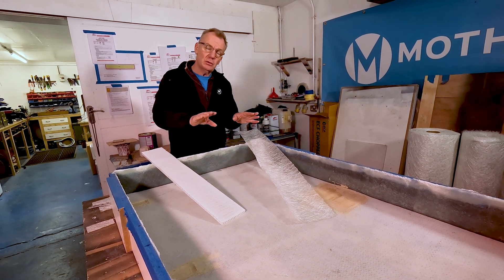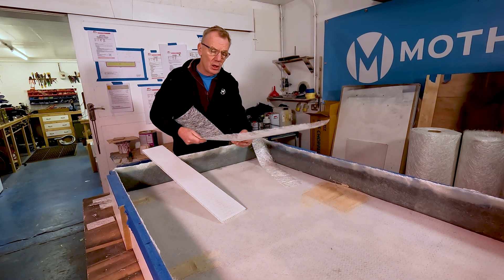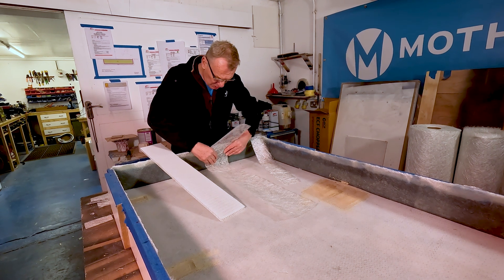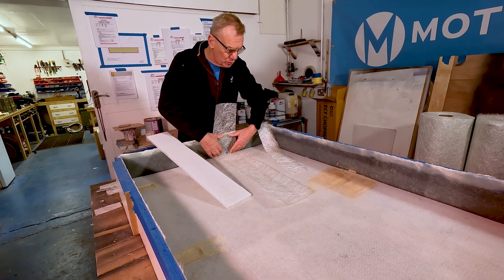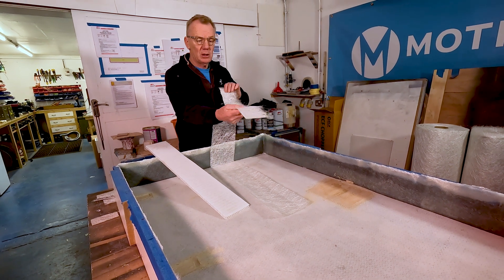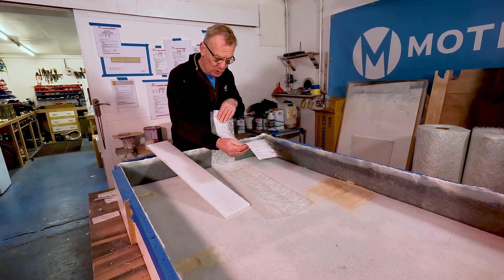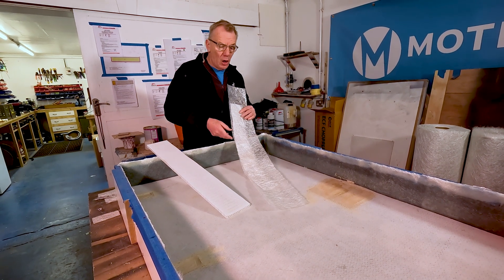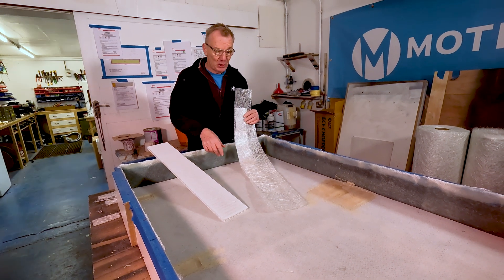How we make it is that from the melamine boards we go through the post process with the waxing. Then we put gel coat on it. Then we put this backing cloth on — which is very, very thin — which enables us to fold it really well into the corners. Then we put this other cloth here which is 300 gsm (grams per meter square), and we put three layers of that on what will be the top, which is now the bottom.